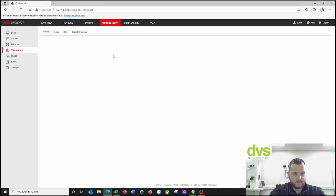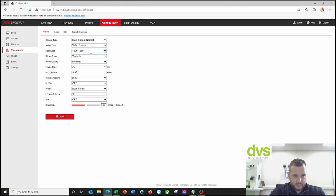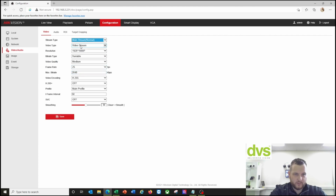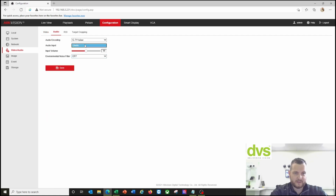Under video and audio, 1080p, 25 frames a second. We are going to change this to H.265 and click save. And then under substream, that's fine. If you do want to use the audio, you need to change it to video and audio. I don't have a microphone connected, but if you do need the microphone, make sure you change the mainstream to video and audio, the same as the substream. But you can see there, they've got third, fourth, and fifth stream available. Audio, that's where you set the settings, line in if you want it, region of interest, target cropping.